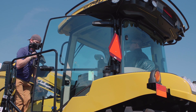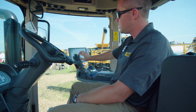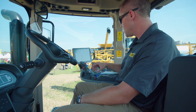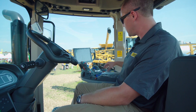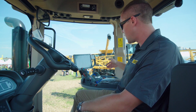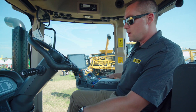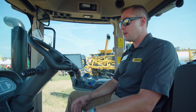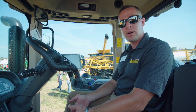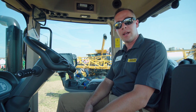I'm up in the cab with the new MT700. A lot of things have changed from our previous models. We're going to have the new AccuTerminal, which now has auto steer capabilities built in — you're going to be able to run WAAS or all the way up to RTK accuracy. The controls on the side are also a lot different. You're going to have buttons over here and everything is color-coded: orange is engine and powertrain, blue is hydraulic, white is electronics and auto steer, and yellow is PTO. That's a brief overview of the cab. If you want to learn more, you can stop by our Farm Fest booth until 4 o'clock today, or tomorrow from 8 to 4, or stop by a Ziegler location. Appreciate you watching — have a good day.